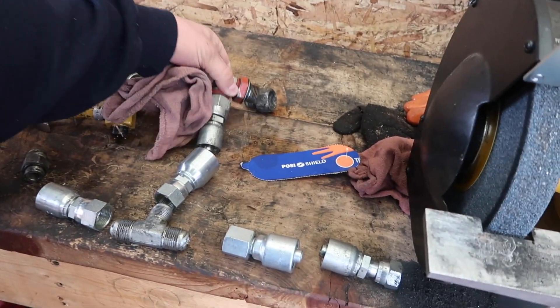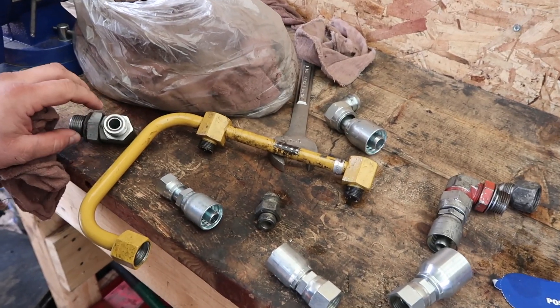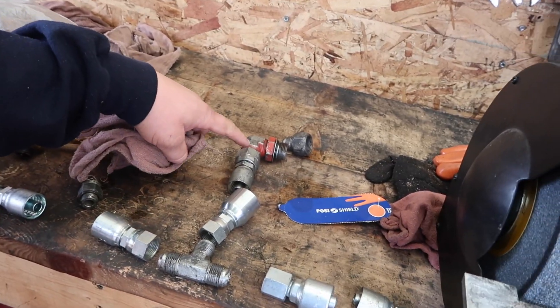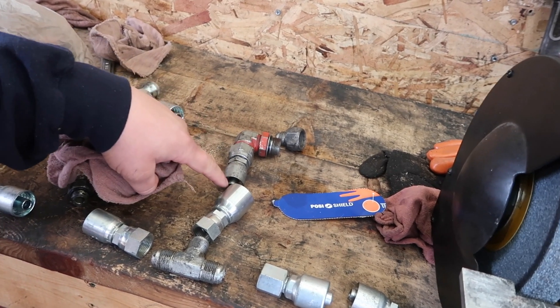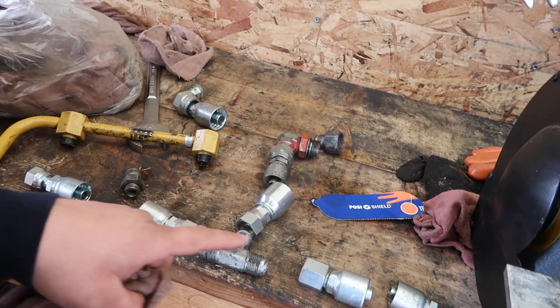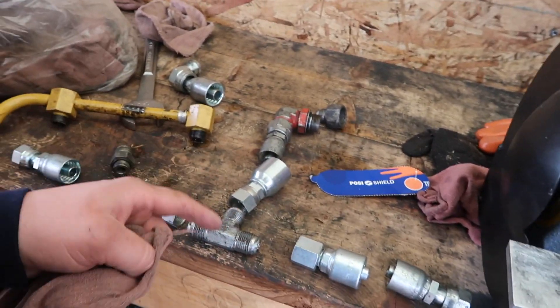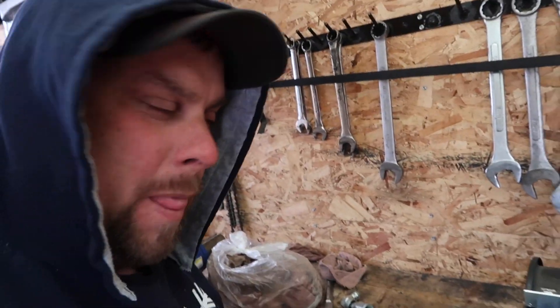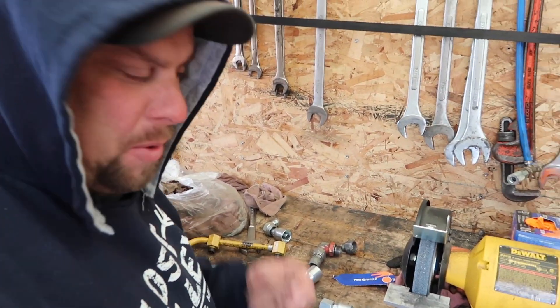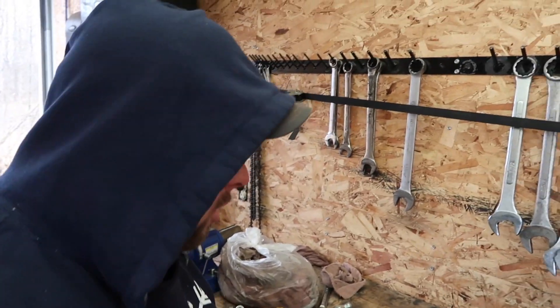What I'm going to do is take this one and switch it to JIC here. I don't have a lot of flat face stuff, especially that 5/8ths. Run that into this, reduce it down to half-inch hose, 3/8ths JIC right here. This hose right here will go up into the cylinders. And this will be your splitter instead of this. So we did it — we're going to start putting it back together. I'll show you what it looks like at the end. This will keep the skidder up and going.